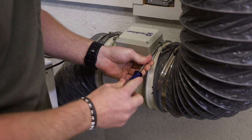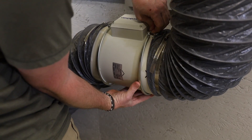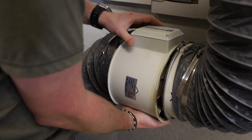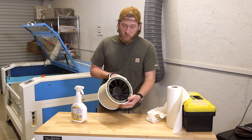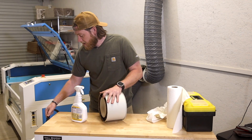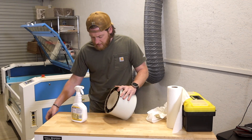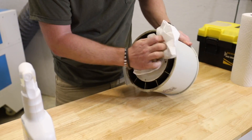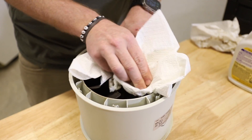Before taking this unit apart, make sure the power is off and unplug it from the back of your laser. Remove the clamps to the fan by finding the corresponding screwdriver and loosening them — there is no need to completely unscrew them, just enough to slide the clamps off those joints. Slide out the fan housing and bring it to the work table. I am going to blow it out with compressed air to get the large debris out, then use a degreaser like 409, spray it in there, and wipe it off. I am not going to take it apart, just clean as much as I can reach and then put it back on.